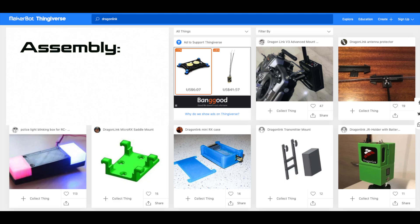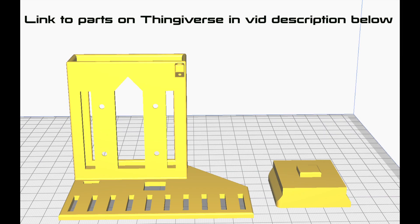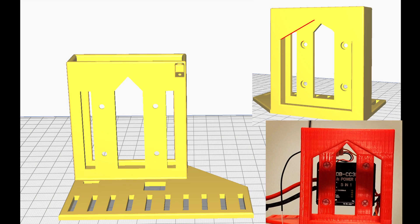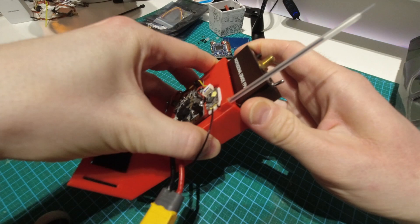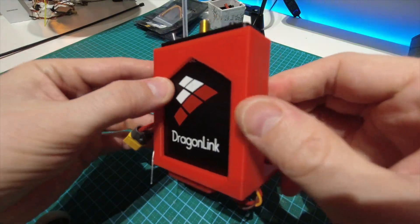Assembling the relay is also pretty straightforward, especially if you have access to a 3D printer. On Thingiverse, search 'Dragonlink' and you'll find a few relays already on there. Alternatively you can use the simple one I've designed, which holds a Dragonlink V3 slim transmitter. There is an antenna tube holder for your 2.4GHz receiver, holes for mounting any PDB with 30.5mm spacing, a battery tray, and it's designed to mount straight onto a tripod with a separate adapter plate so you can use your own if you wish. I simply glued the two parts together using E6000. My Dragonlink transmitter module has a bit of Velcro on it, so the print was designed with that in mind. I used a double-sided sticky pad to hold the receiver in place — and the relay is basically ready to use.